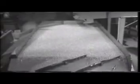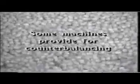Other things also will affect the operation of the gravity table. One of these items is installation of the machine. The machine must be solidly anchored so there are no false vibrations. Remember that eccentric vibration is one of the factors in separation. If there are other external vibrations, adjusting the machine becomes very difficult. Some new machines provide for counterbalancing, which helps.